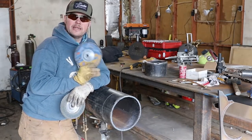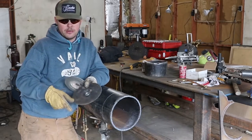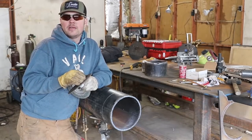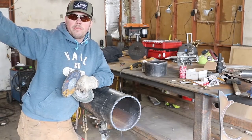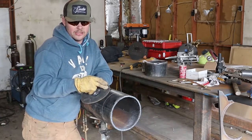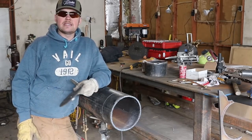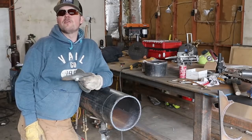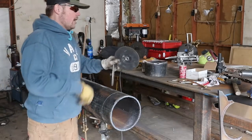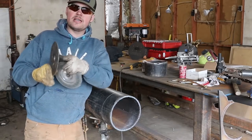The thing about a grinding disc that you gotta be careful about is if you're grinding on this thing, you gotta remember that you're wearing the disc out. Eventually it's going to blow to pieces, from wherever you're being the most aggressive on it. The top of it's going to just blow out. And that's with any disc, it doesn't matter what disc you use. If you are not careful with these things, they will eat your flipping lunch. So be careful with the grinding disc. I prefer a seven inch disc, 1/8 inch wide.